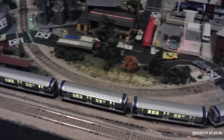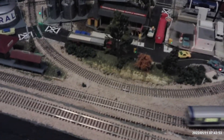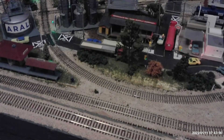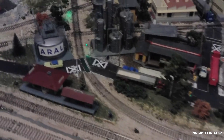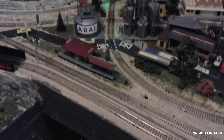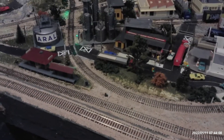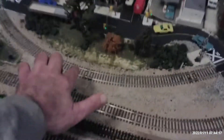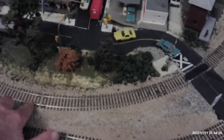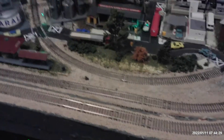What I had to do was — I had some extra BD-20s and I swapped it out, and it still didn't work. It was hooked up to an AIU-01, and the light wasn't coming on the port it was plugged into. I put some jumpers on this track right here and ran those as feeders, because I thought maybe I had a feeder wire problem. But I didn't know why it would be a feeder problem, because the trains ran fine.